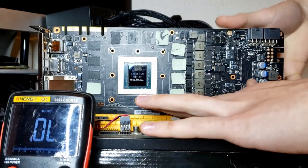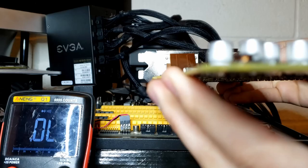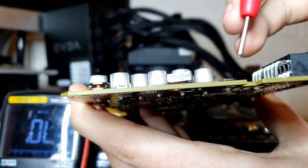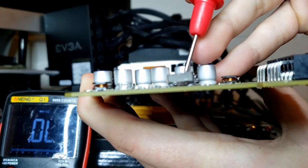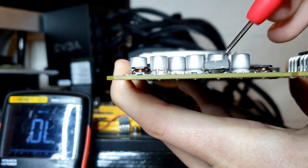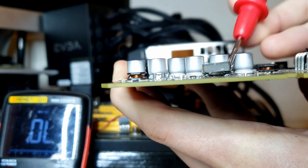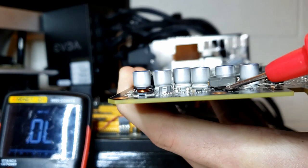This card has actually been worked on. If you look at the inductor here, this inductor is actually a little bit lifted. You can see there's a gap under the inductor — you can see the probe under it. So somebody's been working on this card. They identified the 12 volt short and yet they weren't able to fix it.